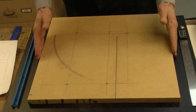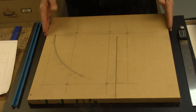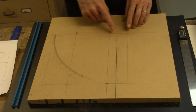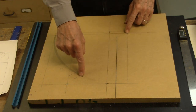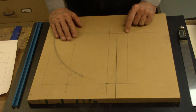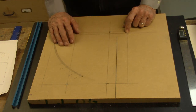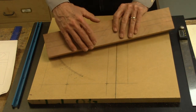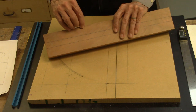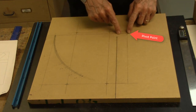This new version of the Celtic ring jig incorporates several changes over the previous prototype for greater flexibility. The table size is increased from 15 to 18 inches to enable cutting larger wood blocks. The cutting angle range is increased from 90 degrees all the way to 30 degrees, though most projects will use a range from about 70 to 45 degrees. The fence height is increased from 2 inches to 3 inches tall, and the pivot point is moved closer to the bandsaw blade.